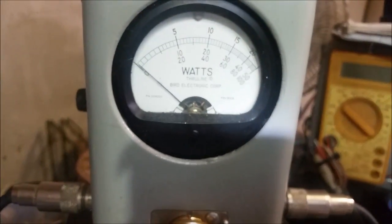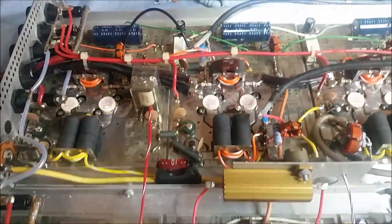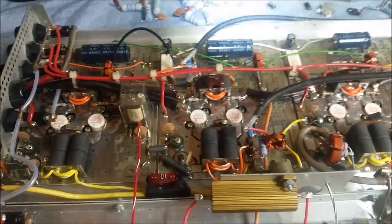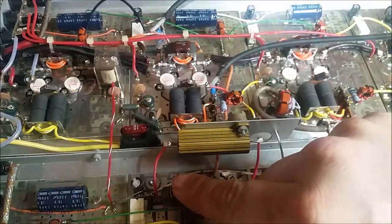The combining is done the exact same way as the splitting, but now you're going from small up to big. I've bypassed the main splitters and I'm going directly to this 4-pill section. The signal goes directly to this splitter, splits off to this 2-pill section and this 2-pill section, and when it's combined after amplification it goes here. I've got output — the 4-pill section is working! So now I have got down right to the essence of the issue. I know it has something to do between this splitter and this splitter. The RF is working, the other sections are working flowing through this network.